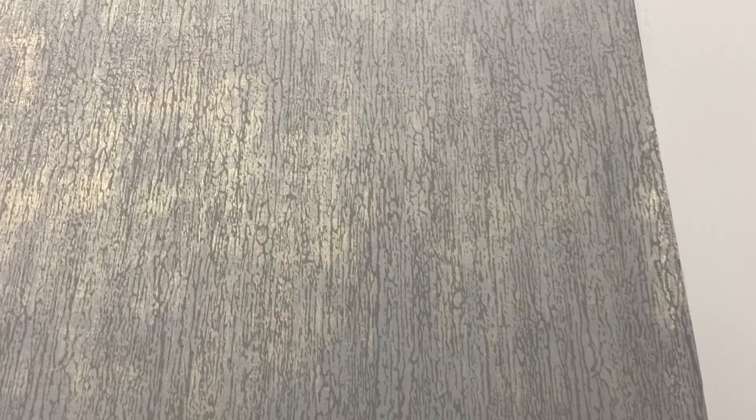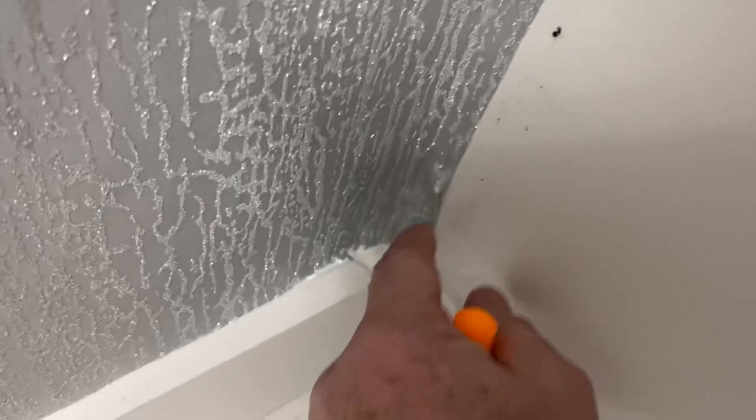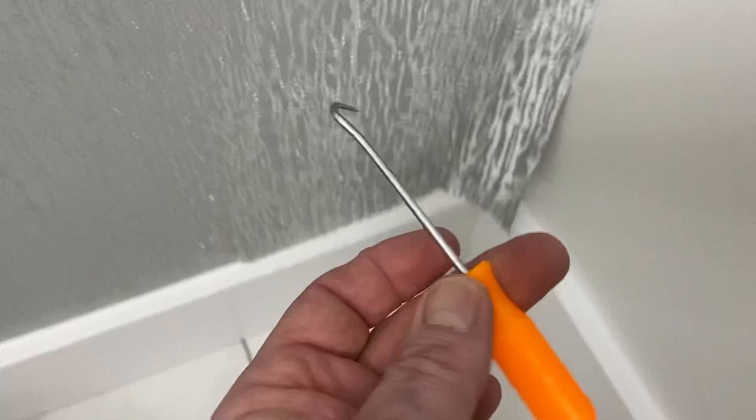Let's back up and see how we did. You can start to see the beauty of this stuff. Don't let imperfect seams interfere with the beauty of the designer who made this product - take your time and charge accordingly. For your baseboard corners, simply take one of your fingers and push the material into the corners so you don't put a cut mark prematurely above the corner. You want to feel that corner and make a mark there. If you need to get this wall covering out of the corner, use a tool so you don't get paste on the front of it.